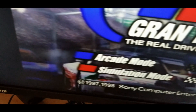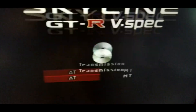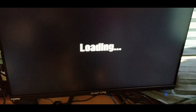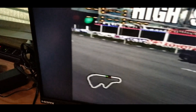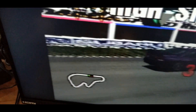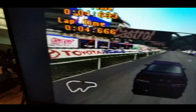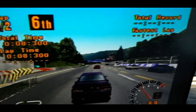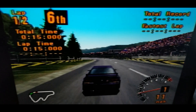So you should be able to hear sound effects. I'll just load up a race here. We do have some kind of loop playing here in the background, but there is no audio track playing right now. There should 100% be an audio track playing. So yeah, we're not getting music on this PlayStation, at least for the videos and for some of the in-game audio tracks.